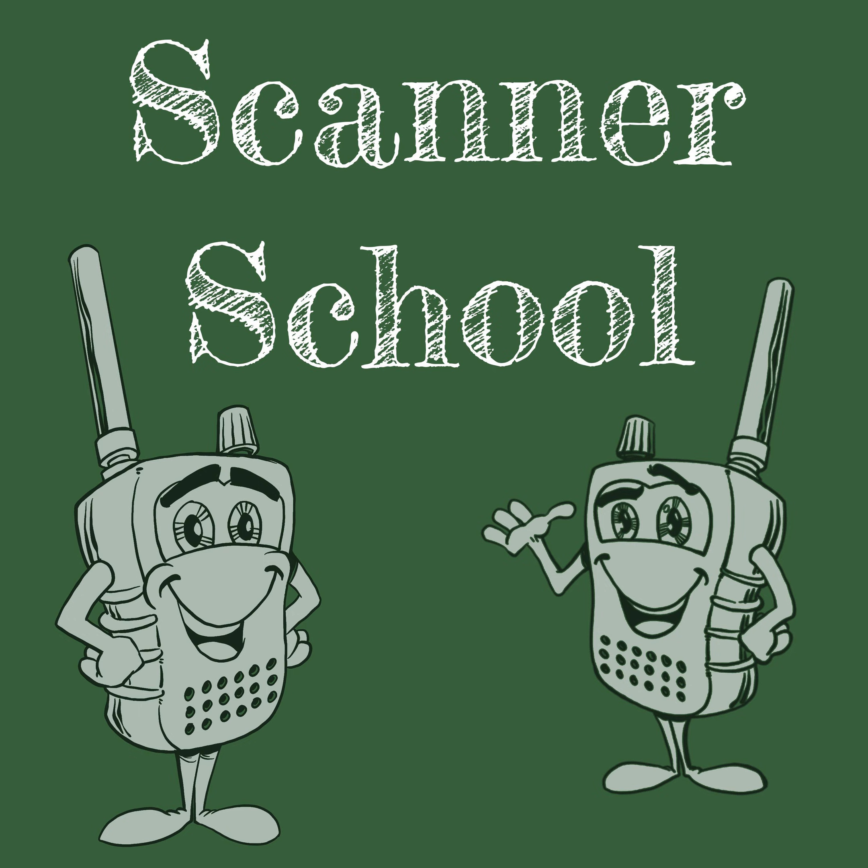Here's another important tip: when you save changes to your scanner, do a factory reset, or set defaults, it's only going to make those changes to the V-Scanner you currently have loaded. It will not factory reset the entire scanner. V-Scanner 1 requires you to manually store or save the V-Scanner, and V-Scanner 2 in the newer radios will automatically do that on the fly.